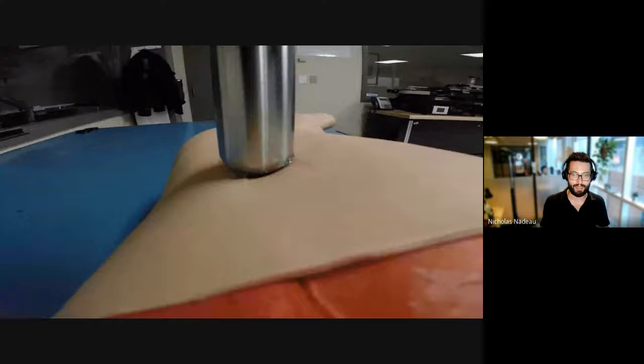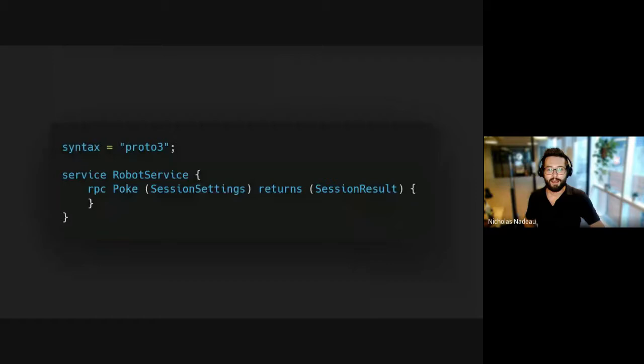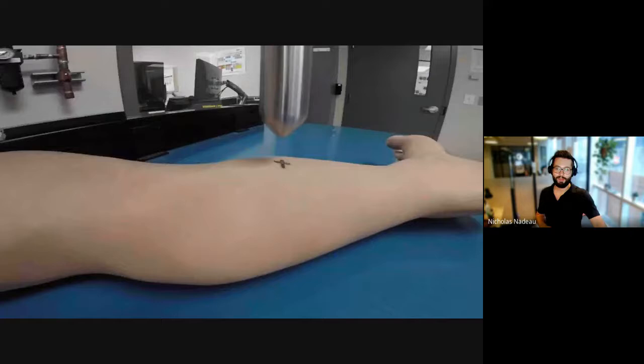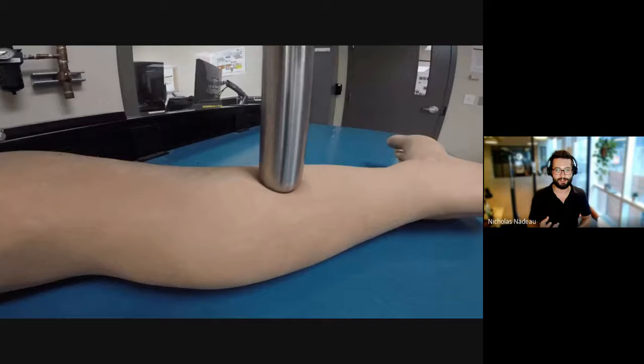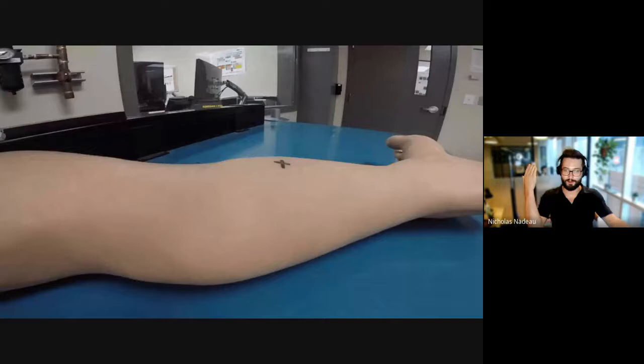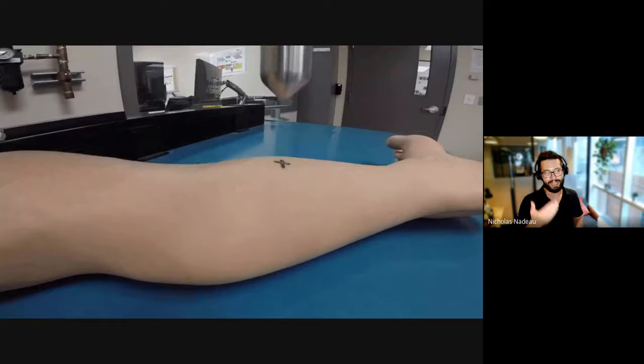And this leads me to one of the silliest and potentially stupidest, but a lot of fun, experiments I designed. I programmed the robot to poke automatically. I had it learn how to poke. In robot medical ultrasound, it's an example of a task where simply stopping the robot upon contact detection, like you would typically do in a lot of industrial scenarios where if it makes human contact you just have the robot stop and then you reset the robot, is not an appropriate reaction strategy, because you get into a clamping situation and you don't want to clamp a human to a medical table.